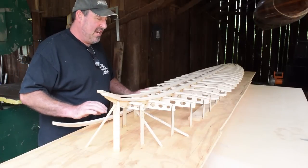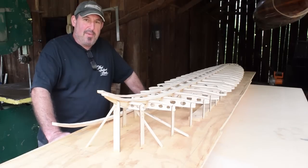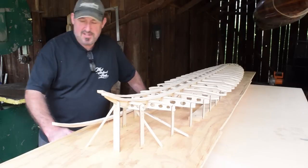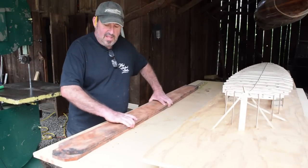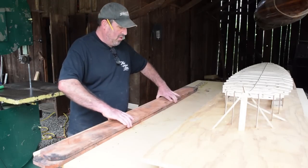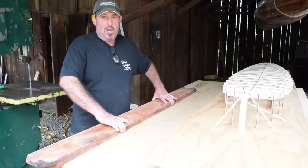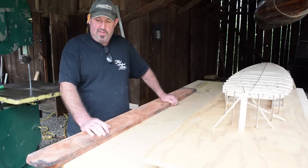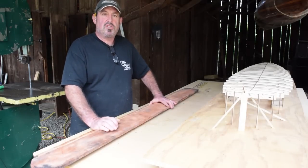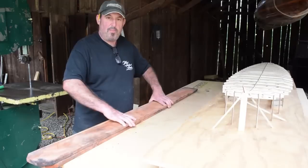The next way I want to teach you, we're going to actually take straight pieces and bend them. I'm not great at steaming lumber, so I have another trick up my sleeve. My trick is I picked out some redwood boards that are right out of the mill. These boards weigh an absolute ton — more than oak. The reason I picked the heavy ones is they are full of water. There is no steaming necessary with these boards. You couldn't get any more moisture in this wood by steaming. Rip this up and it bends easy.